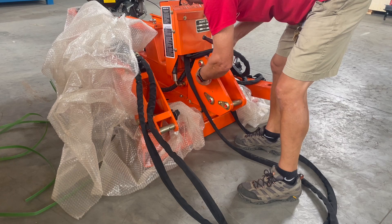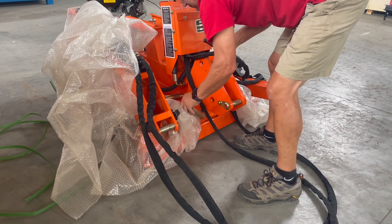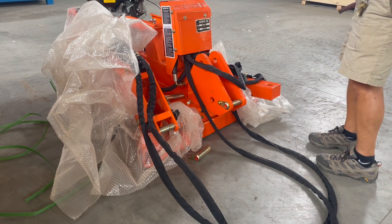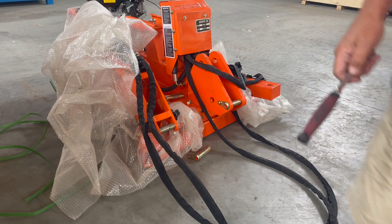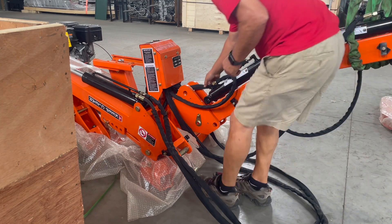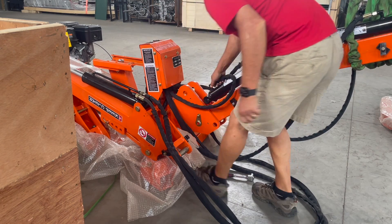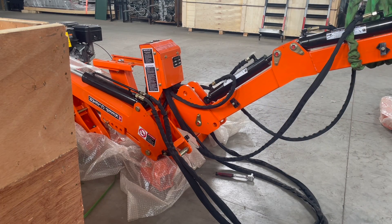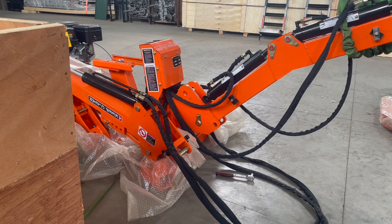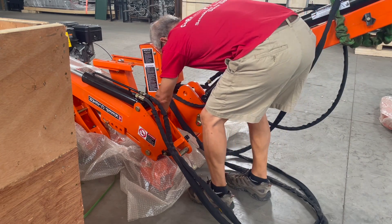The upper pin I'm taking out right now is the one that takes the hydraulic cylinder. You take them off — there are a variety of ways you could do that — and you can take the other pin out and slide the arm right in there. You can see that we have the center pin in, and we're getting ready to adjust the hydraulic cylinder to fit exactly. We just lifted it up until it was at the right angle.